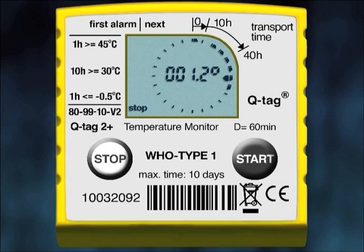If there is an alarm in the time segment, when you press the Start button again, a time indicator along with the alarm sign will appear in the center of the screen, and the limit indicator will appear pointing to the type of alarm setting violated. In this example, a minus 0.5°C exposure for at least one hour was violated, and this happened exactly at 11 hours and 20 minutes after the start of recording. The next pressing of the Start button gives the lowest or highest temperature recorded during the violation — here, minus 4.2°C.